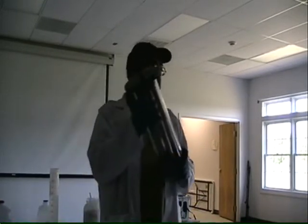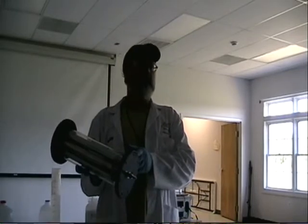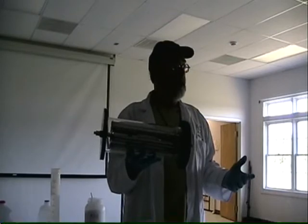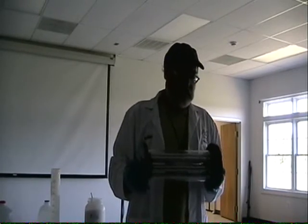I'm going to test it with conventional Faraday. The way the cell is set up, it's just seven tubes on one plate and one contact — seven tubes that slide inside on another plate on one contact. It's simply a big single pole cell, or two pole cell. Because of the way it's built, it's very robust — it's 316 grade stainless and can probably handle two or three hundred amps. I want to get the Faraday numbers on it, see how it comes out, see what it'll do.